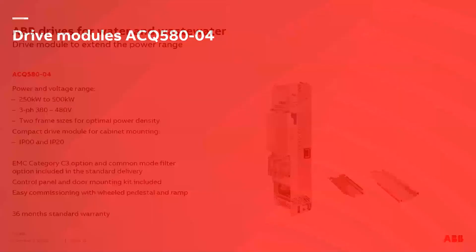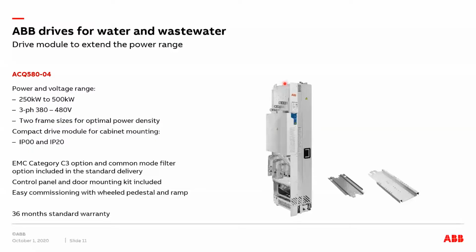Right, then we get to the modular unit here. Of course, as I said, this is more for a scenario where it's going into an existing panel or a new panel. That goes from 250 to 500 kilowatt. And to move it around, it's actually got wheels at the bottom, so it's quite easy to move around. And there it's got those little ramps. So if you need to get that into a panel, you can basically clip that onto the bottom of the panel, and you can roll this into the MCC.